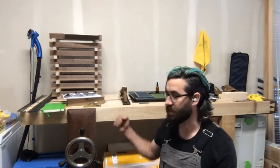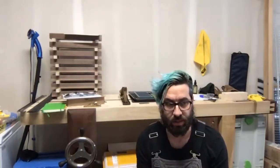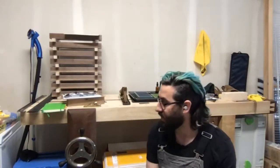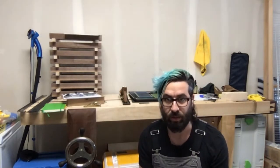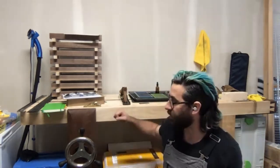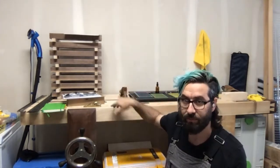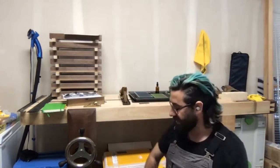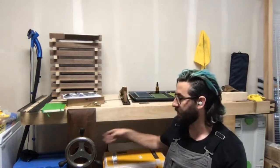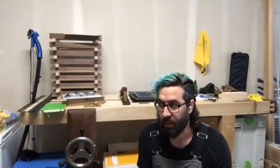My first real project was this workbench. I had a lot of help doing it. I worked in a class at Plate 11 Studios in Ozark, Missouri. We built the vast majority of it in a week. It was 7 days back to back of work, getting everything together, from raw lumber to laminating the tops. There are two separate tops, a front half and a back half. All the permanent joinery on each of the legs, and then temporary joinery for attaching those to the frame and to each other. Everything we did in the week.